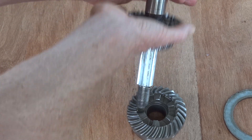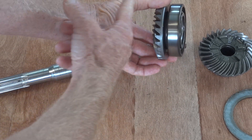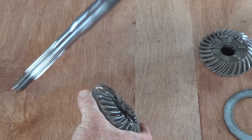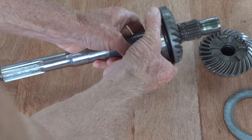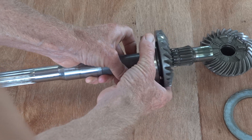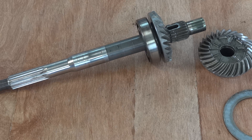But it doesn't really suit putting it around the other way — it doesn't fit over the shaft. There's a nice solution at hand, because the lovely people at Timken make a tapered roller bearing that's exactly the same size as that ball race: 45 by 85 by 19 or whatever it is. So that still goes there, we replace that with the taper roller. To stop it rocking — since we're always in gear with this thing — the dog ring will hold that to that. We can put a sleeve in there, press it onto the shaft and hold it true. The taper roller will be happy and we'll have a bulletproof, durable bearing support arrangement.